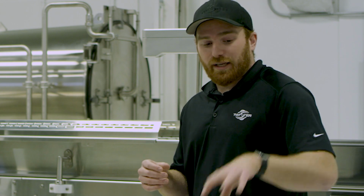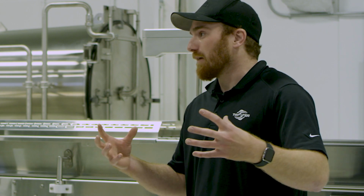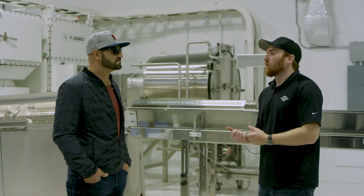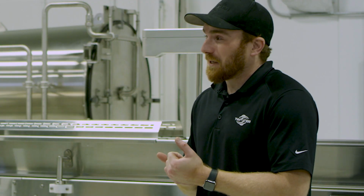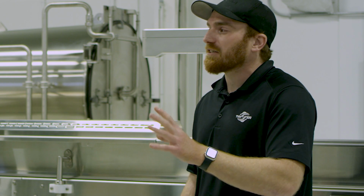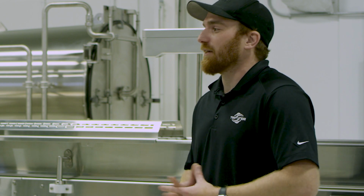But with that being said, the blades underneath will then start to get more and more built up. Best thing you can do is trim in a very cold environment. How cold? What I always tell people is as cold as your employees are willing to work in, but at least around 15 degrees Celsius, you're going to see significantly less buildup.